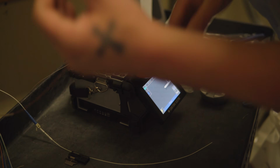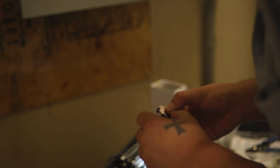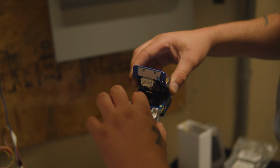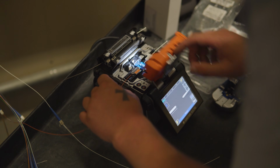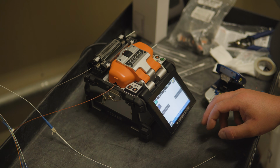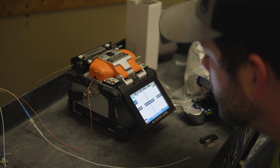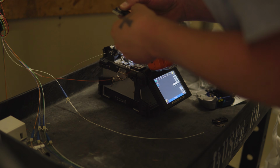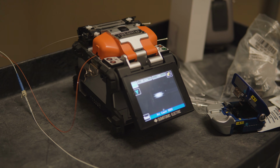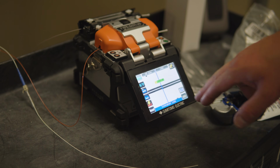So here we're just showing the splicing of the fiber optic cables, correct? Yep. So to make those final connections for the signs to be able to control them. Yeah, so basically we just needed to terminate the fiber. So essentially the fiber has its glass, and so this little fusion splice machine, I'd never seen anything like it. Pretty cool, but basically you can see there on the screen it's lining up the two pieces of glass, and then once you get it in alignment, you hit the OK button and it splices it together and comes out with the termination on. It was just so cool. So there you can see that's arcing or fusing, and boom, you can inspect your splice and test it. Pretty neat. Really cool.